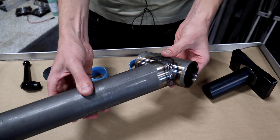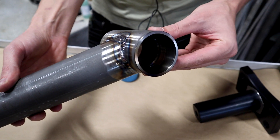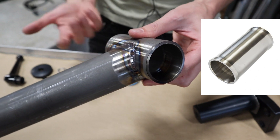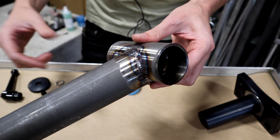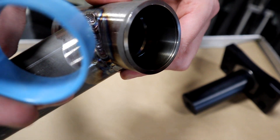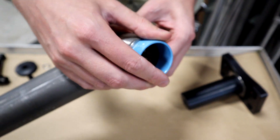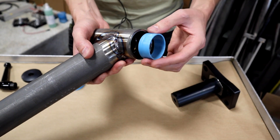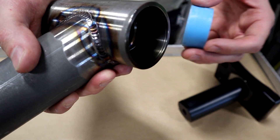On the top end we have the round tube. I cut these to length on my automatic bandsaw, then turn them on my CNC lathe and bore them out — just like Paragon Machine Works makes CNC-machined 44-millimeter head tubes. There are really cool details in here. First, there's a larger-diameter step right at the mouth of the bore. When you're starting this bearing by hand without a fancy press — we assemble these before we ship them so you don't have to do this generally — that step makes it much easier to start the bearing straight.